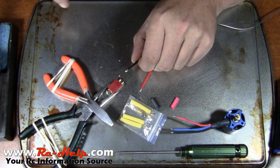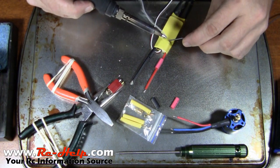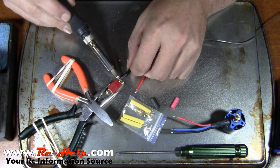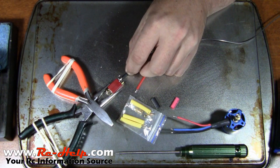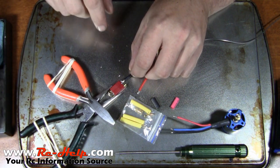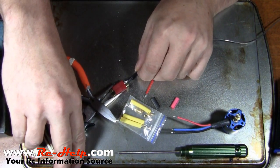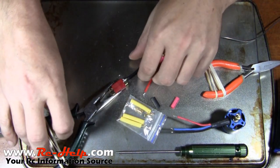I like to try to keep my wires straight, so I'll grab the wire — if you've got real sensitive fingers you might want to use pliers. Grab your solder and iron and tin it. You've already got both areas tinned, so just apply heat, wait for it to melt both pieces, and hold it together. You'll see it: when it's liquid it'll be a glossy shiny coat, and once you see that dull area going over it, you can grab it and pull to check if you've got a cold solder joint.